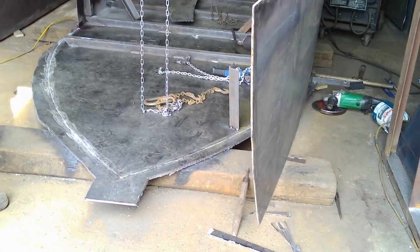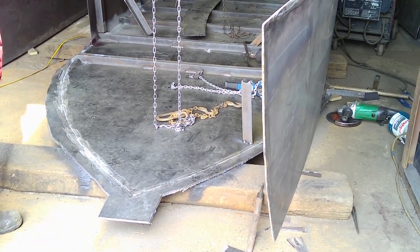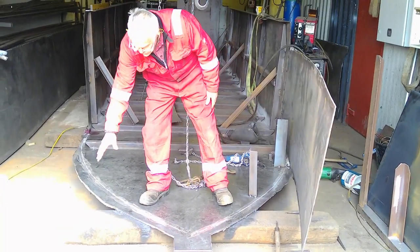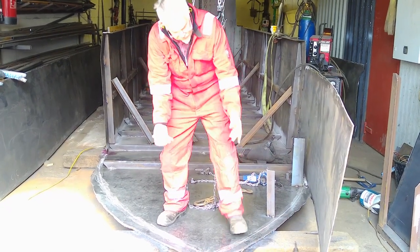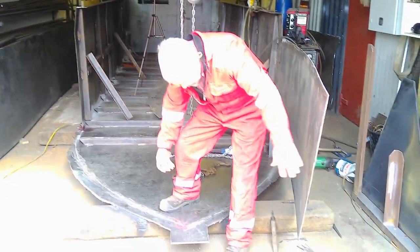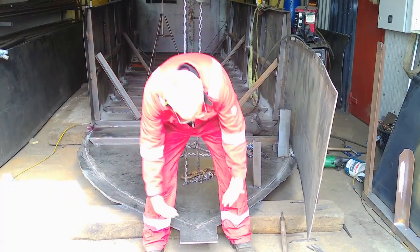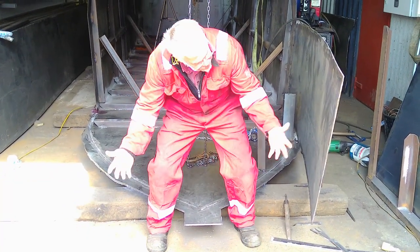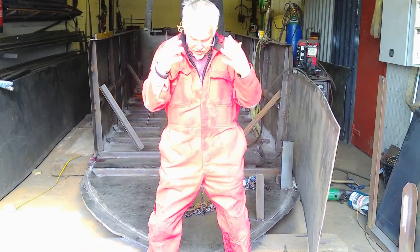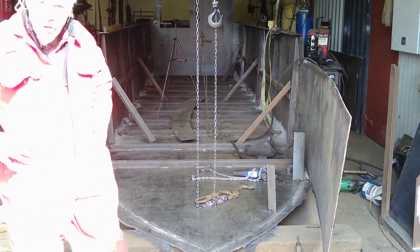It will also lift up off the deck so this base plate comes up a little bit to meet it, just to be pulled up and welded on. So that's how they go. We'll take a pull from the bottom of that plate and the bottom of the starboard bow plate, and as we pull them in together that bow section which has been developed should start picking up. The bottom crawler should pick this one up at about that height, then all the other will close up and you get really nice fine lines to make the barge a pretty thing.